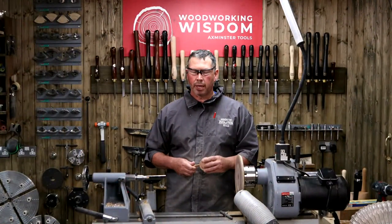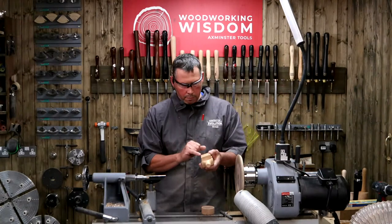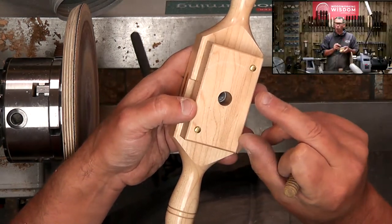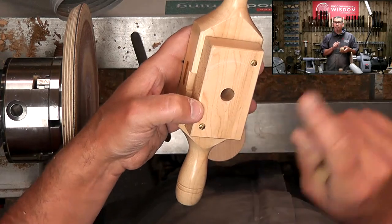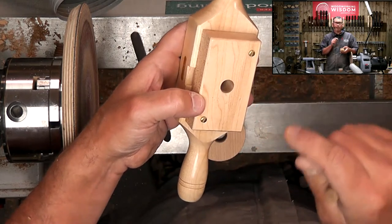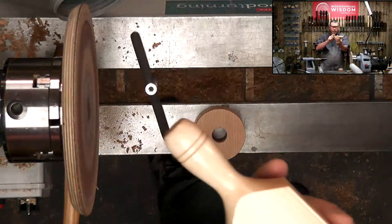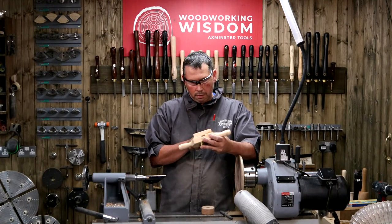I would say probably that the start of that would be, I'm guessing, where you join into this square section. Maybe you're a little bit too small for that, the thread box. So if you can get as close to that diameter as possible, then figure out the exact position for the cutter. It might be that. Apart from that, in a vise, we were all taught this at school, using a die up in a vise, leveling it up by eye to start with, and very gently starting that first cut. I think that would be the only advice I could give on that, really. Getting as close as you can to the diameter of that lead-in hole.